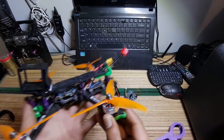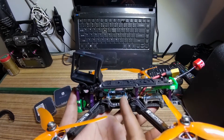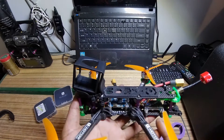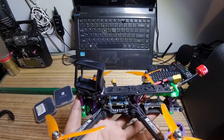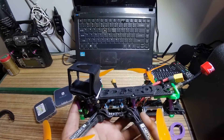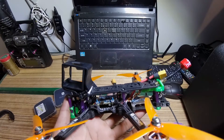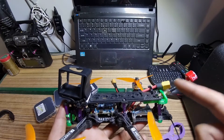The stack is fully put together — flight controller, ESC, and VTX. I didn't have to solder anything on the flight controller, just plugged everything in. The only soldering required was the motor wires, the battery lead, and the wires for the receiver.